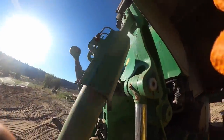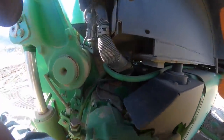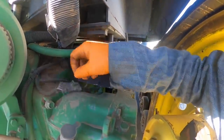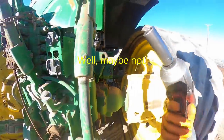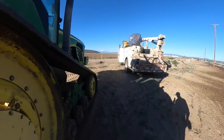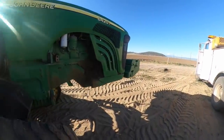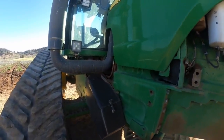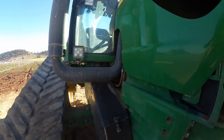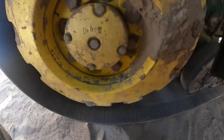This is your steering, and this is your steering motor. This is your steering speed sensor right here. It's fine. It has the right voltage and everything when you do the test. God, it makes me wonder if there's a tone ring in those things. I wonder if the tone ring has come loose in something and it's bouncing around. It's kind of what I'm wondering. I don't know. I'll zip this plate off of here. It almost acts like the tone ring inside that motor or something has come loose and it's doing a bunch of goofy stuff.